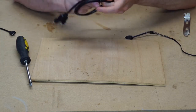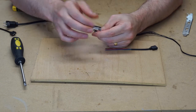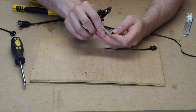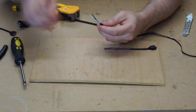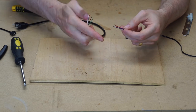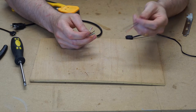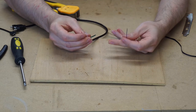To do this, we need to cut the cable to length, then strip the wires back on both ends. The USB cables tend to come shielded, but we don't need that, so we can just chop that off. Now we've got the wires exposed. Most wires already line up by colour, so I'm lining up red to red, green to green, and black to black. The RGB system has a blue whereas the USB has a white, which makes it easy to replicate the cable again.